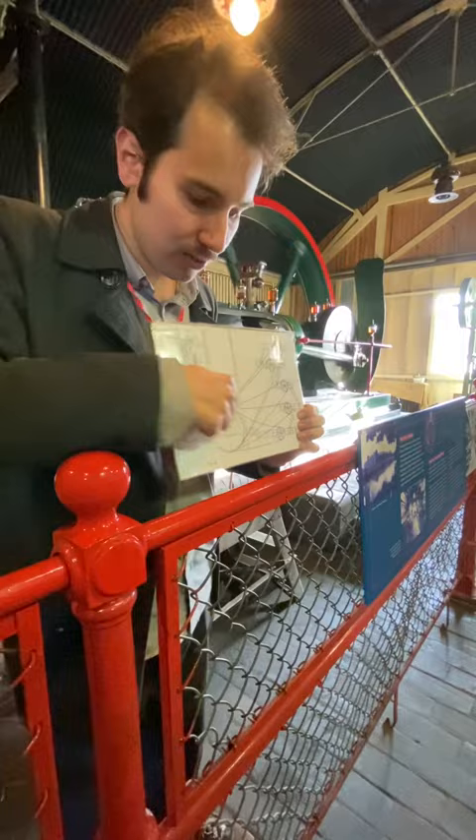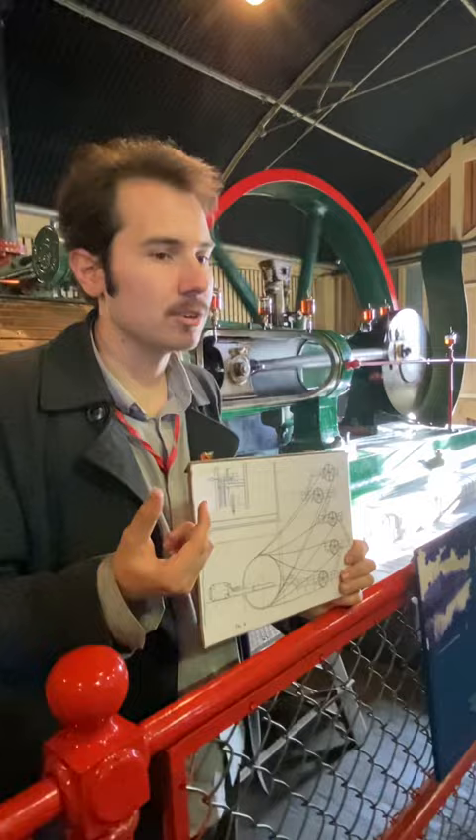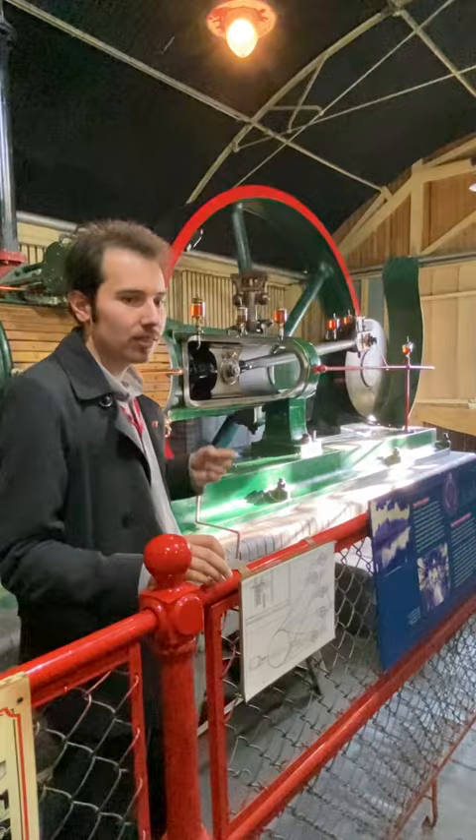If you've never seen line shafting before, there's a nice diagram in the corner. We've got our power source: a piston inside a cylinder going back and forth, which turns our large flywheel. On the outside of the flywheel in the black section you can see there are eight grooves — in each one of those grooves there would have been a rope, an inch and a half in diameter. As they went around the flywheel, it pulled the ropes to turn all these various shafts. There are two miles of line shaft in the Sleaford Maltings, with hundreds of individual pieces of equipment taking power at any point, and this one engine alone could have powered the entire site.